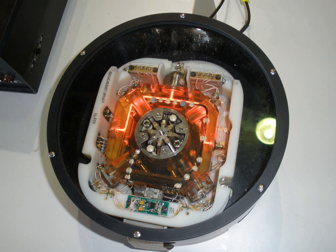The first experimental ring laser gyroscope was demonstrated in the U.S. by Macek and Davis in 1963. Various organizations worldwide subsequently developed ring laser technology further. Many tens of thousands of RLGs are operating in inertial navigation systems and have established high accuracy, with better than 0.01 degrees per hour bias uncertainty, and mean time between failures in excess of 60,000 hours.